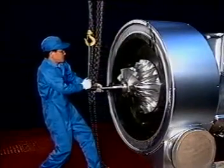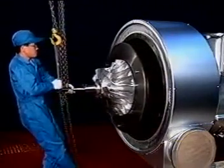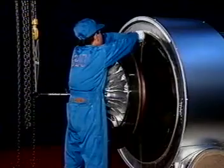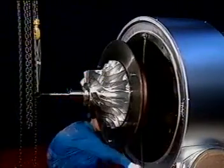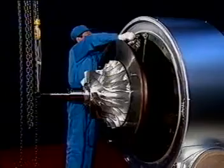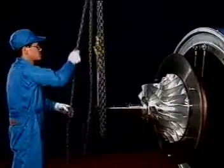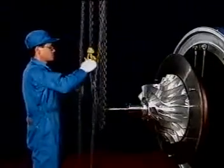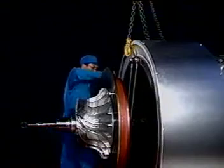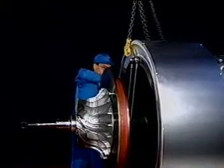Carefully pull out the rotor until the pin touches the guide plate. Bolt the sling rope to the air outlet casing and support the rotor by the rope at shaft protection sleeve. Remove the wire rope from the eye nut. Suspend the rotor by the wire rope at shaft protection sleeve.